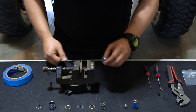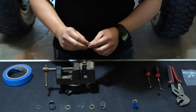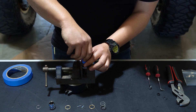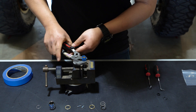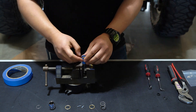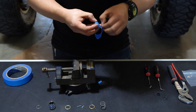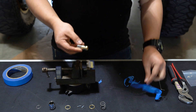So there's your components. Now we'll put it back together. I'm going to put it in the vise. Plunger goes down — make sure the spring is there, that goes in first. Just set it in there. Make sure the plunger goes inside that seal as you screw it down. Hand tight, then use your plier wrench. Doesn't take a lot — once you hit metal to metal it'll stop spinning, that's all you need. Now at this stage we can take off the tape. Surface still looks good.